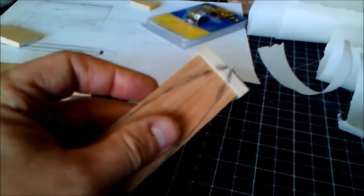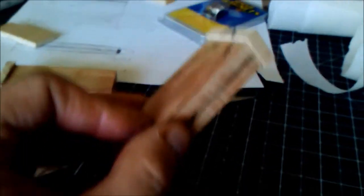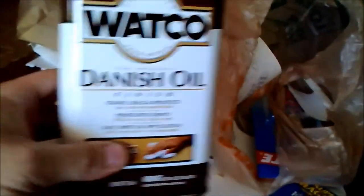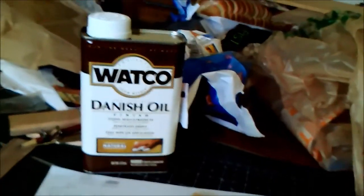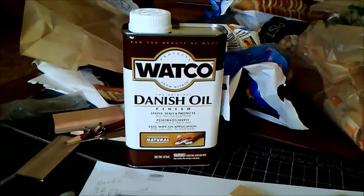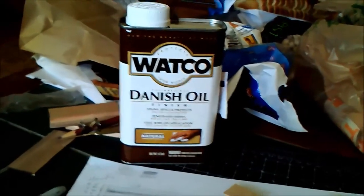The idea is to take this down very, very slowly. Once I'm done with the power sanding, I'm going to hit it with some hand sanding. After that, I'm going to work in a little bit of Danish oil — it makes a really, really good hand-rub finish and looks amazing once it's done. I want to keep the oil out of the inside of the hilt piece because I'll be epoxying in there and epoxy probably won't stick well to an oil finish.